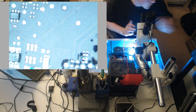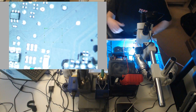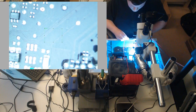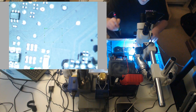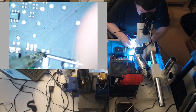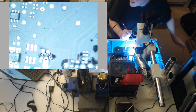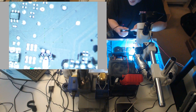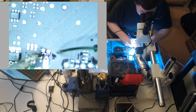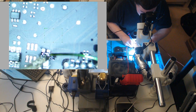So here's what we're going to do. We're going to inject voltage and see what gets hot, and then we're going to get our FLIR and have a look. So let's solder wire to the backlight fuse, which is PP bus G3 hot, and see what is shorted. Watch this be a true dead ISL just trolling us. If that ISL gets hot, I'll laugh. I'll laugh because this stuff always finds its way to happen to me.